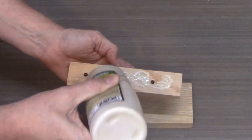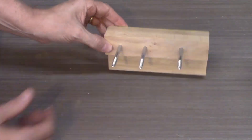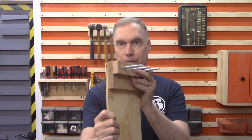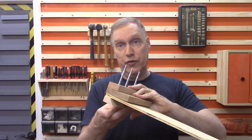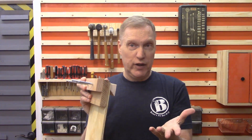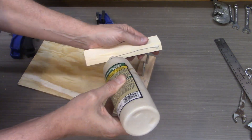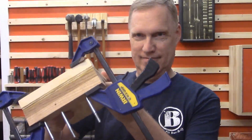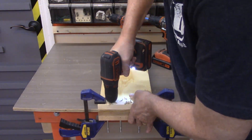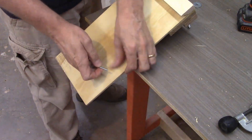Assembly of the hangers is pretty simple — just put some glue on, push the bolts through, and you have three hangers that can hold a whole lot of weight. The hanger is then attached to the backer board, with the three hangers screwed in from the back. I'm going to glue and screw this because this is some pretty heavy stuff. We glue and screw a lot of wood structures here — the glue is cheap and easy to work with, but we live in a swamp and you never know, even with waterproof glue, whether it's going to let go. Each 2.5-inch screw has a pilot hole and a countersink because it has to sit flat against a French cleat wall. A spare machine screw is added partway down the backer board for the pipe cutter to hang on.